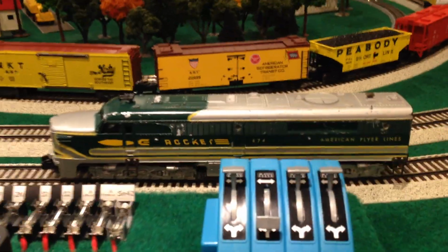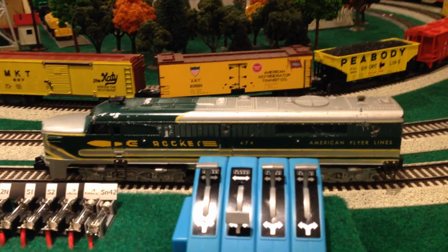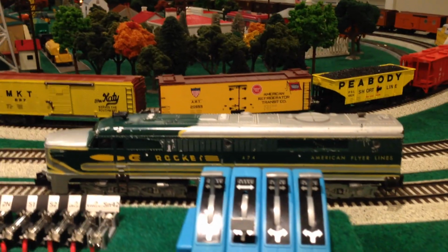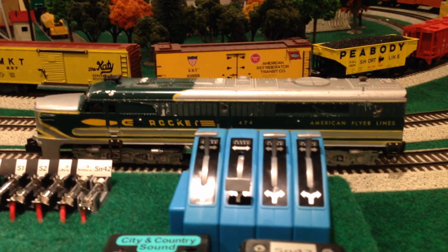What was interesting though is its reverse unit had both the upper and bottom fingers worn through, so that was disassembled and both sets of the reverse unit fingers replaced. It's working rather well now too.